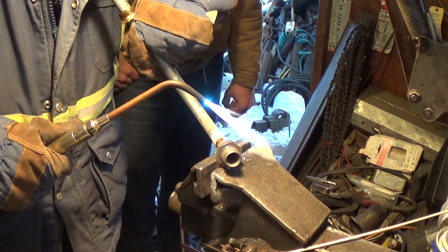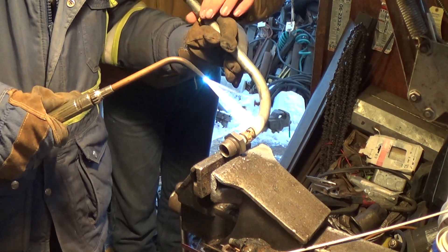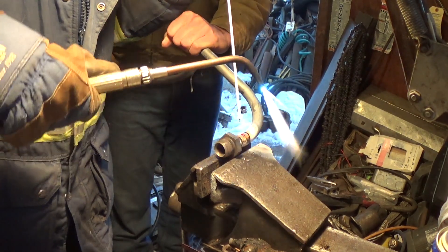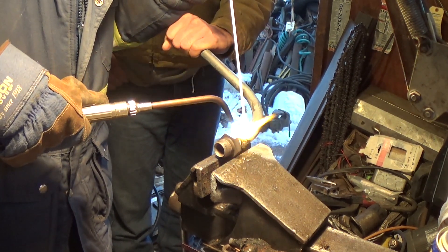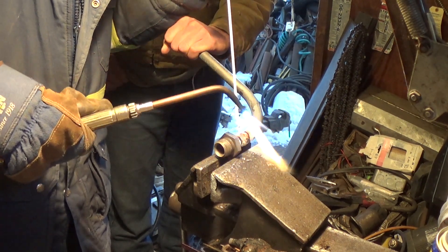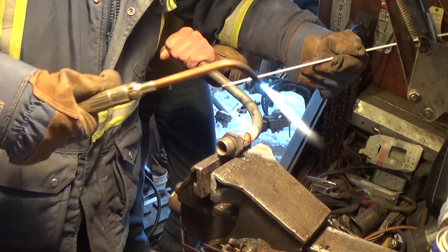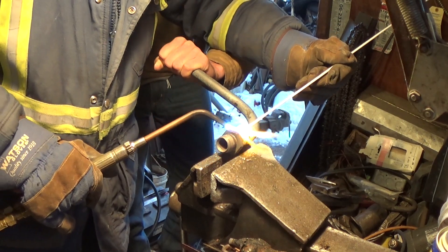In this application, what he's putting this on — it's a return line, so it's low pressure, probably no more than 300 PSI. I'm going to put one more spot of weld right there. My dad welded many of these hydraulic fittings on steel lines when they got damaged and you cannot find a replacement steel line anywhere. People say, 'I'll just change and go to all rubber line,' but if you're inside of a frame somewhere on a machine, you do not have room to do that. You are literally bound to reuse, or sometimes we've had to actually take a steel line off another machine to properly fix it. It's just the nature of the beast — it's how you have to fix things to get yourself going again.